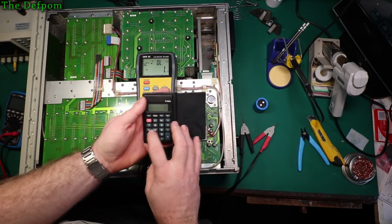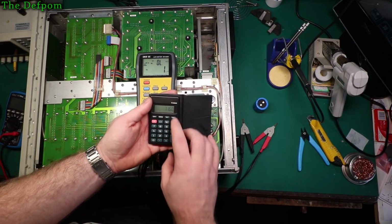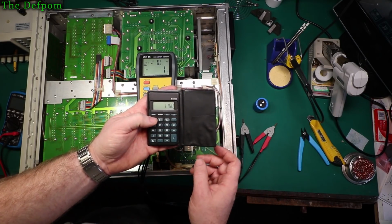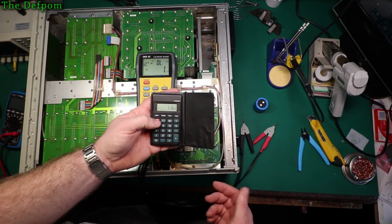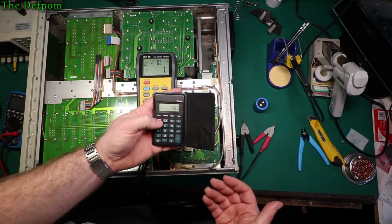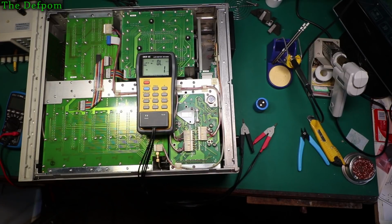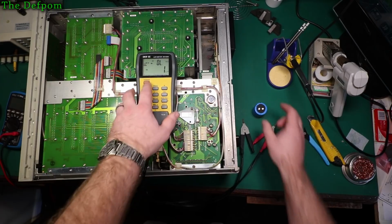Okay, 5,800 times 0.2 equals, could be 1.1 thousand UF up or down, right? Based on tolerance. So it could be closer to 7,000 UF or as low as, was it 4.7 thousand UF or something. That is the tolerance range on that cap if you're assuming 20%, which is typical. So I think using a 5.6 is absolutely fine, so I'm going to use that.